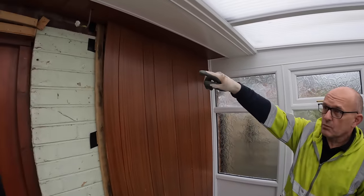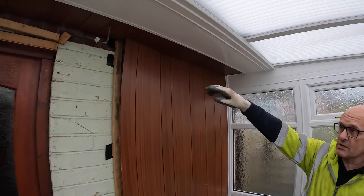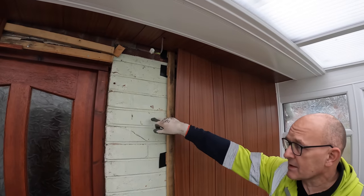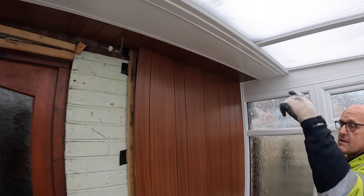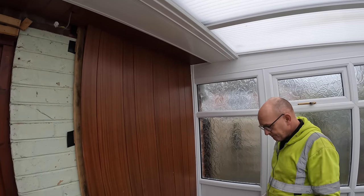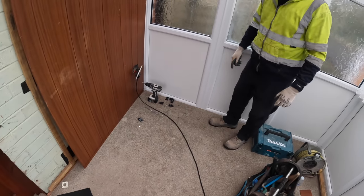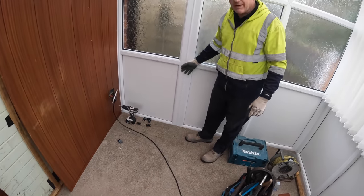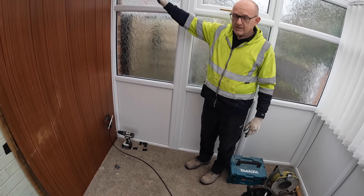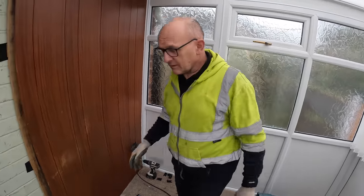There's two steels, maybe one. You might only need one to hold the roof up, because obviously there's no brickwork above that bungalow. So I don't think we're going to need a steel for this outside skin. We'll just need the internal one to hold the wall plate for the roof. It's a timber floor, so I don't think we'll need to fix the floor, because the brickwork's going to come roughly through here anyway. And then we've got a window to brick up in the kitchen as well, so that you can have the wall units coming through. Actually, there's nobody in there, can I show you?